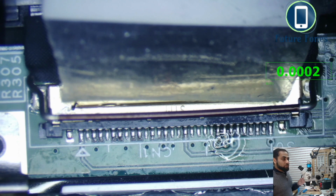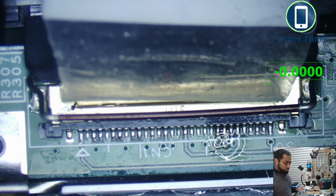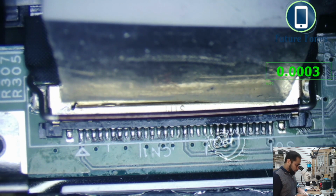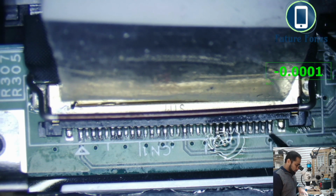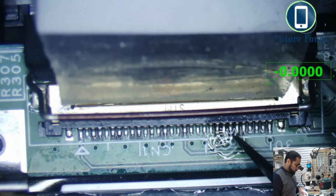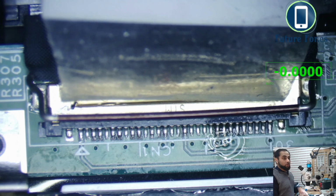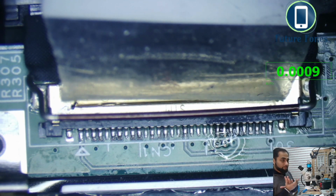So let me go back into that image. Pin number 22 and 23 should be connected together. I will count one more time. So this is 30, 29, 28, 27, 26, 25, 24, 23 and 22. So this connection is good. So now what we have done, we have given the power management's 3.3 volt to the enable pin also, and let's check, do we get a backlight.